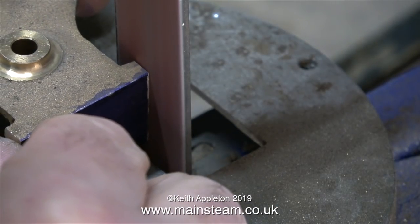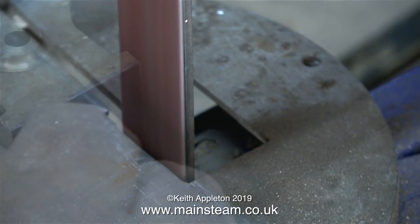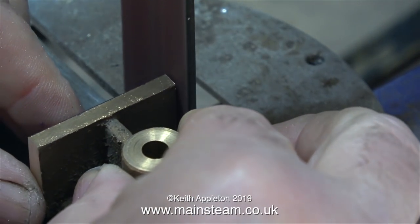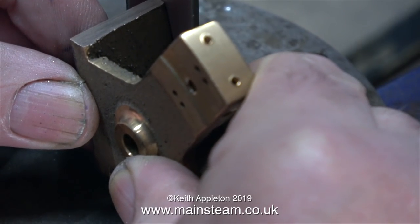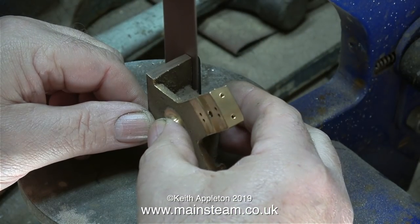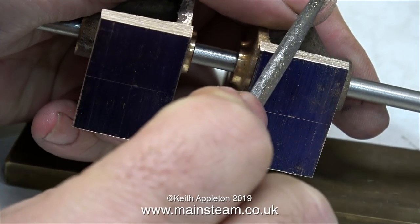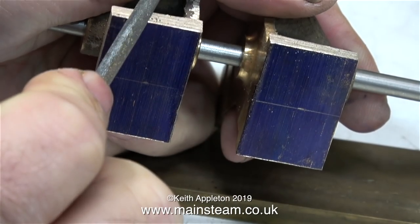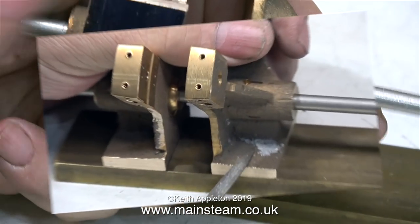But a word of warning - don't get carried away. Two things are going to happen: if you get carried away you'll remove too much metal, go beyond the line, and then the job's spoilt. And don't forget, because of the friction generated by the sanding belt, the part is going to get hot. It's a good idea to wear gloves when doing this, but I've already explained many times why I don't wear gloves in the workshop. In every one of my videos I'm showing how I do the job - how you do the job is entirely up to yourself. But eye protection and a breathing mask is recommended for jobs like this. It's common sense really.